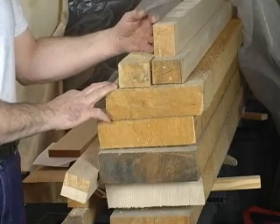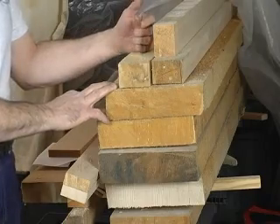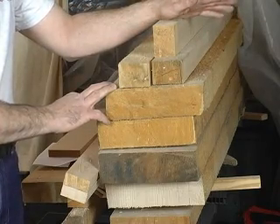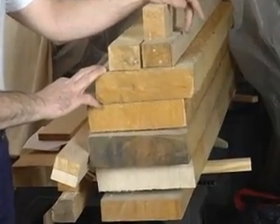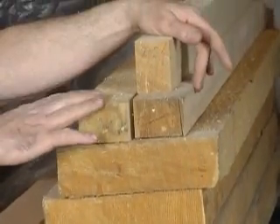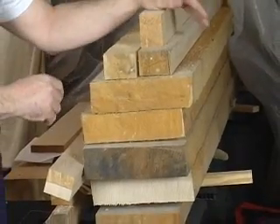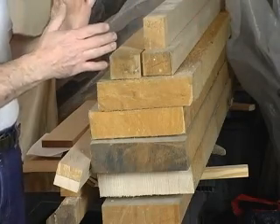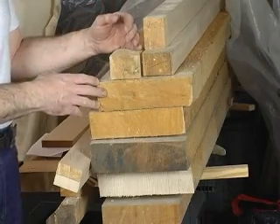Wood is typically cut one season in British Columbia or Alaska, then shipped to a lumber yard as logs. They grade it in their yard, and if you have a salesman you deal with, they'll tell you what they have based on what's been graded for that season. Then they put it in a kiln and dry it to a specific moisture content. You have to buy quarter-sawn wood, which is a very small portion of the log, and the grain runs almost vertically in each piece.